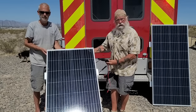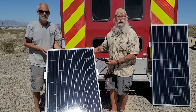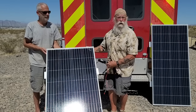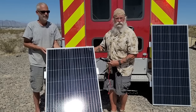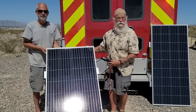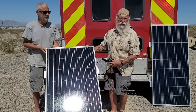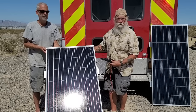So when you test your panel, don't just lay it on the ground. It's not noon yet - it's only about 10:45. At noon it will get even more power. This panel is putting out more amperage than it's rated at because it's a good solar day. If there were any clouds or haze, or if the sun were lower on the horizon, it would put out less. You have to factor all these things in when you test. It's putting out 10 amps at about 21-22 volts - perfect. Both panels are working exactly how they should.